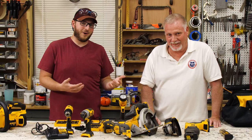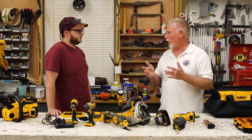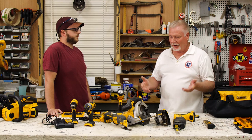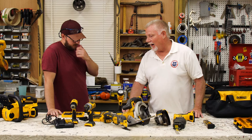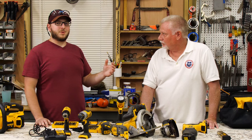Things survived for 30 years and then Cole comes around and breaks the damn thing. They're really for tight quarters — that's what the right angle drill was developed for, to get in between stud spaces and drill a horizontal hole. They're not for everybody — probably 98% of the holes you'll drill you can drill with a regular drill, but there'll be a few that just really mess with you and you'll need a right angle drill. I sold that separately through Facebook Marketplace for $80.